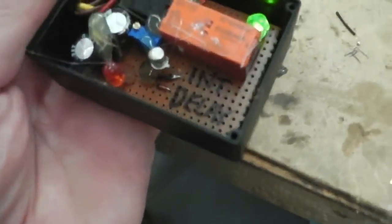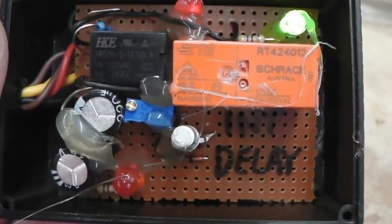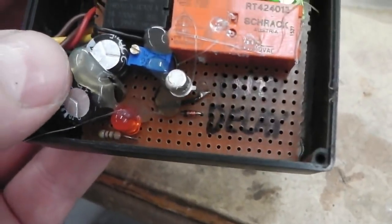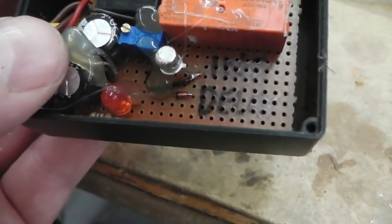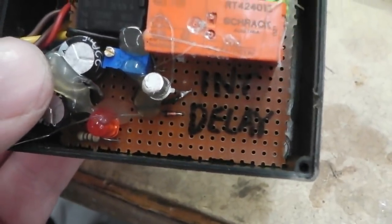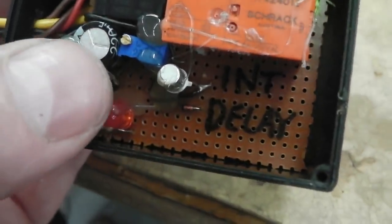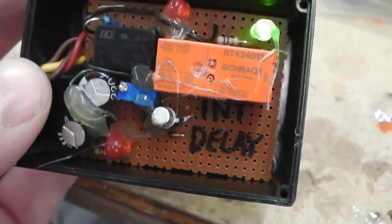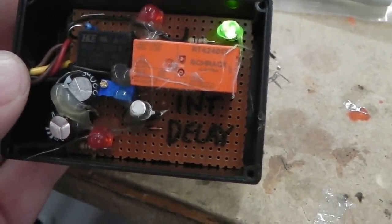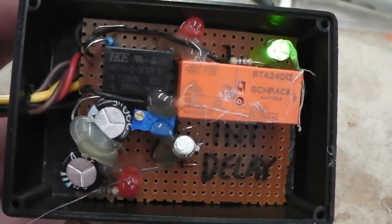A little bit intricate working on Veroboard. You sometimes put little jumper links across, and try to plan it out so that it's in some kind of order. Doesn't always work that way. Glue gun there to stop the capacitors wobbling so that they don't create a dry joint or break off the board at the back. It's just to stabilise it a bit. Very handy for that. Again, I've glue-gunned the trim pot, that little trim screw, so that when the screwdriver goes in it's not wobbling around all over the place. And that's it really. LEDs are glued as well because they could wobble. Anything that's top heavy on the board you try and glue down, and a glue gun's perfect for that job.